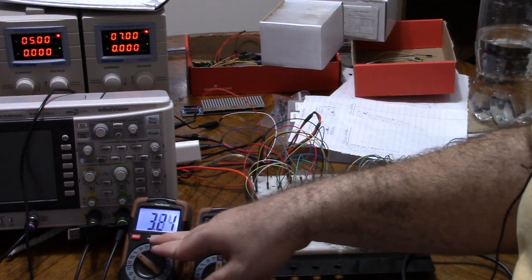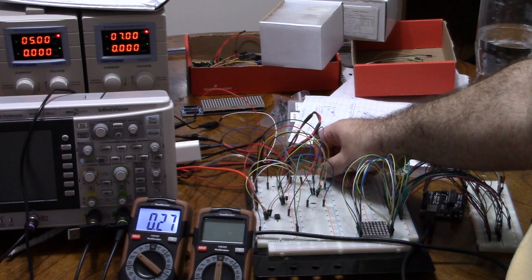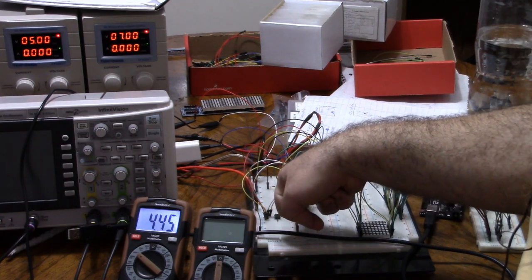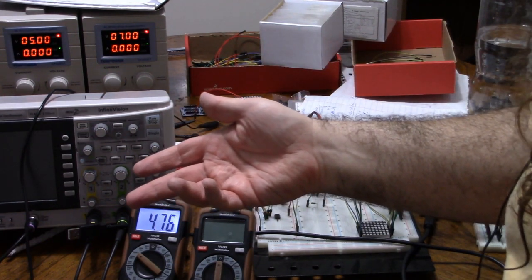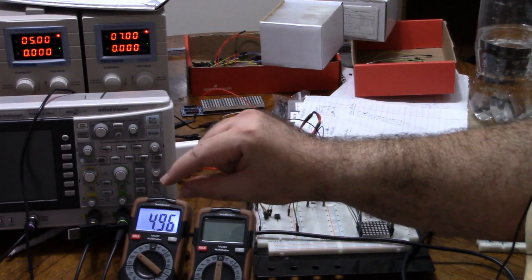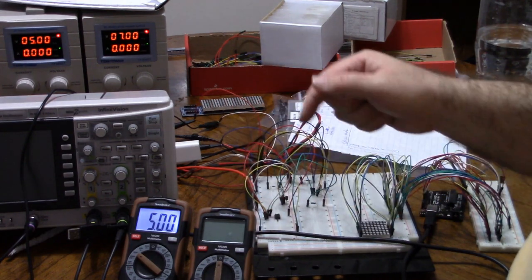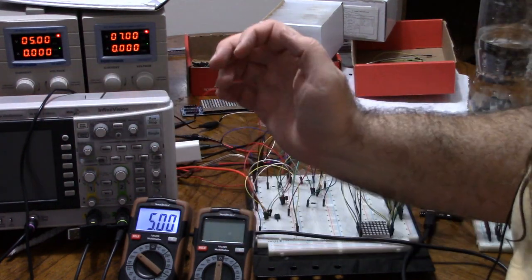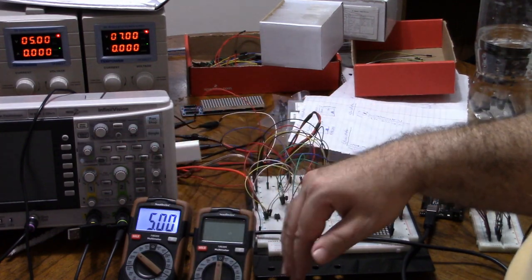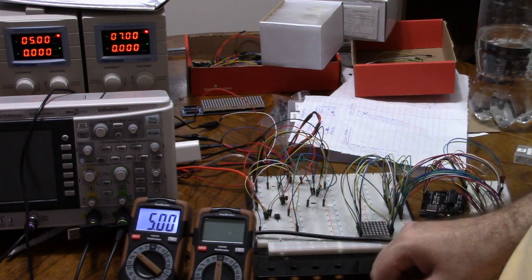We're still sitting at full voltage. The power supply is not registering any current throughput, so we're not wasting power. But if I disconnect the power — bam, it drains extremely quickly. Then if I let it charge again it charges slowly, and as soon as I take the power out it discharges quickly. I've got it charging over a few seconds and discharging over about one to two. The circuit needs one extra drain resistor, one JFET in depletion mode, and one diode to make sure the capacitor does not charge too fast.